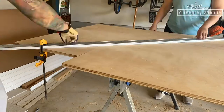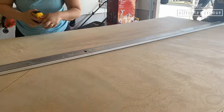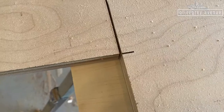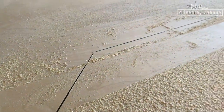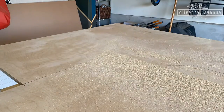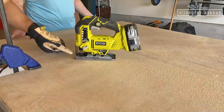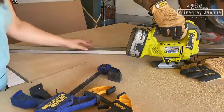We cut a really long piece here because we are using that side for the waterfall edge, so the wood grain falls continuously over the edge. The biggest thing we learned when cutting this plywood is that you definitely want a blade with the highest number of teeth you can find. We got one with 40 teeth and it made such a beautiful cut — no tear-out at all — which made me feel comfortable using this for a nice application like a desk. The circular saw couldn't get into the corners, so we came back with the jigsaw to get that extra inch.